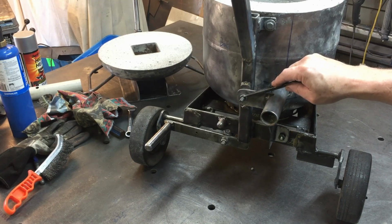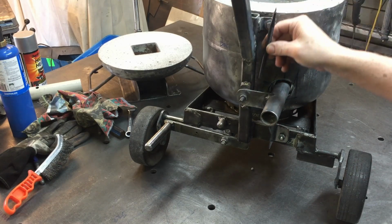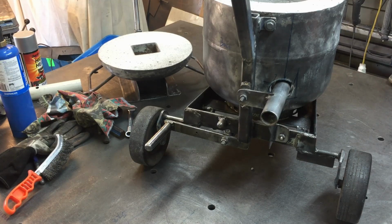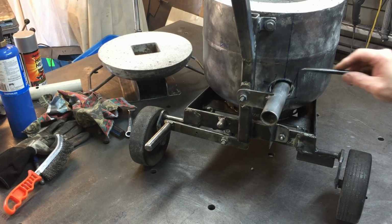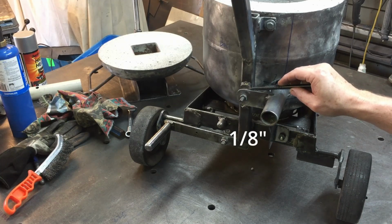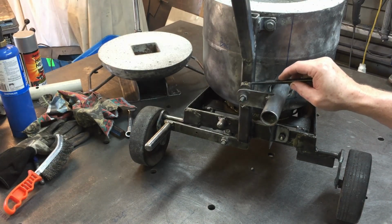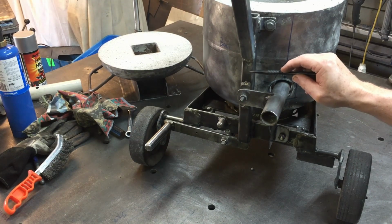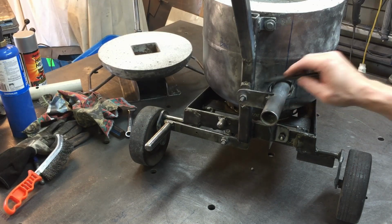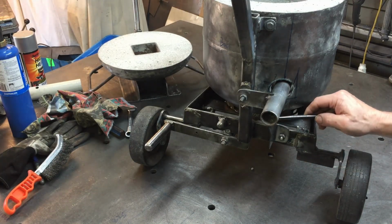And then that was fine, but then I realized later that when I put the lid on and the bar comes down the center, there's now a bolt through the center. So I had to backtrack on that and come up with a different design. So I've got a 3mm plate here, and I've welded this bolt into the 3mm plate, and then I've welded the 3mm plate onto the square section, and that way this bracket can go through the bolt and be bolted on. Down the bottom there's a plate that sort of runs along the length here.